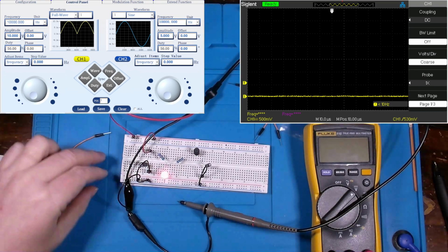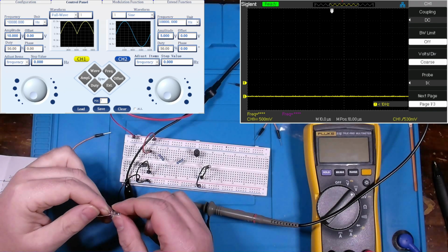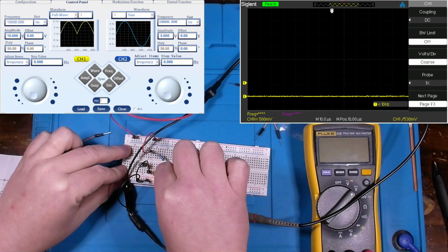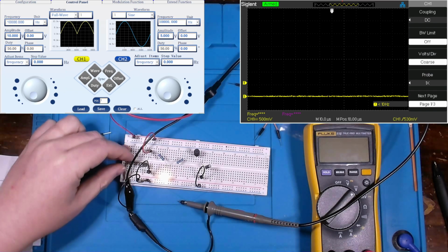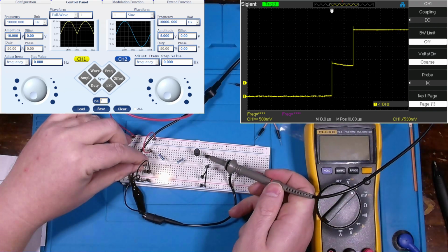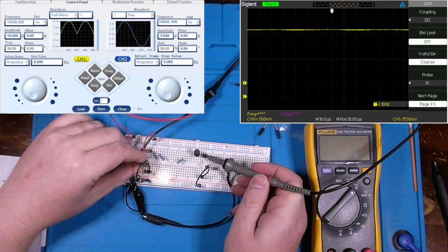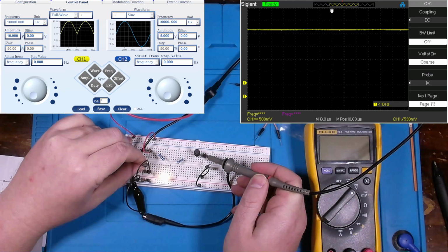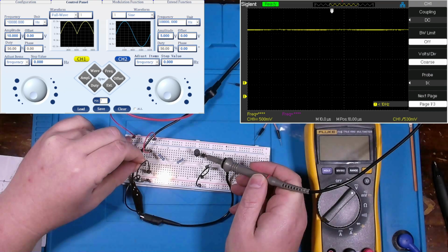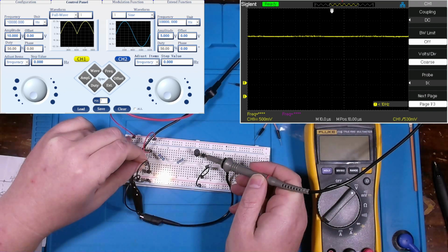Okay. Now I'm going to swap out this light changing LED for a standard white LED with a 3 to 3.2 forward biasing voltage. Okay, and then again, this is without ripple on the front end and without ripple on our output. Now I'm going to remove that 100 microfarad cap at the beginning, and that LED got just ever so brighter. Did you see that? And our output got slightly dirtier.